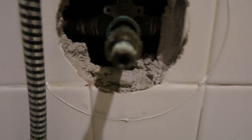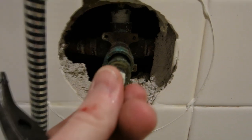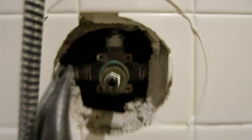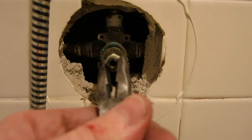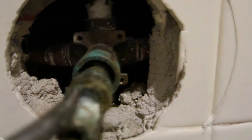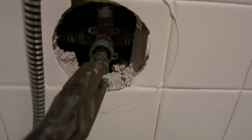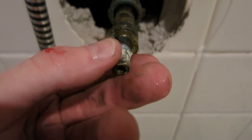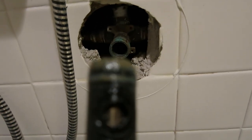No special tool needed in my case. When it was originally in there, there's a little lip right there. Instead of a special tool, I just jimmy-rigged the needle nose in there and turned it about 90 degrees because they were face up, then turned them to the right. Then I grabbed the end of the stem and just pulled it out — you're just going to tug it because you want to get it through this black O-ring right here. This is what's keeping it sealed in there. Now that it's out, the culprit of these bad stems the majority of the time is just these black O-rings. There's one right there on the end with all that buildup — that is a bad O-ring. And then down here we have another O-ring as well.